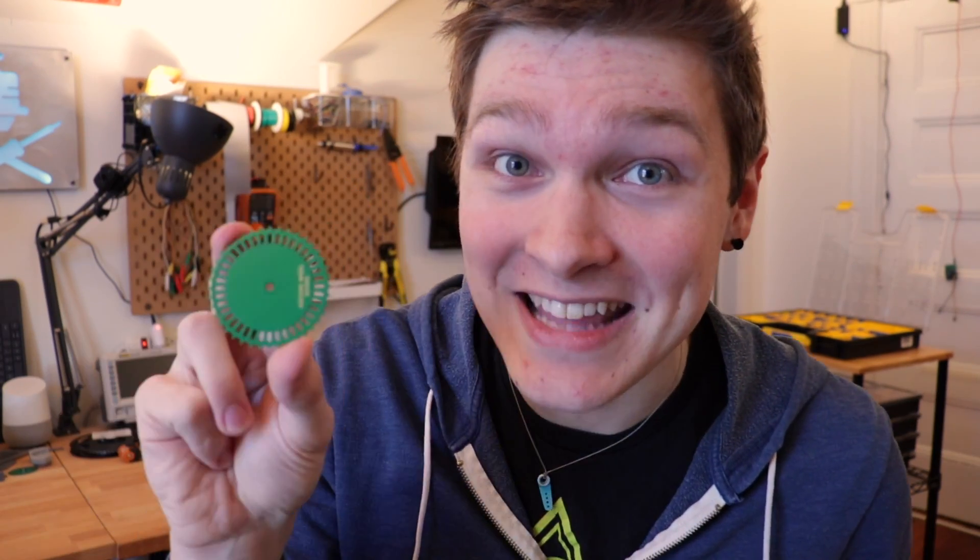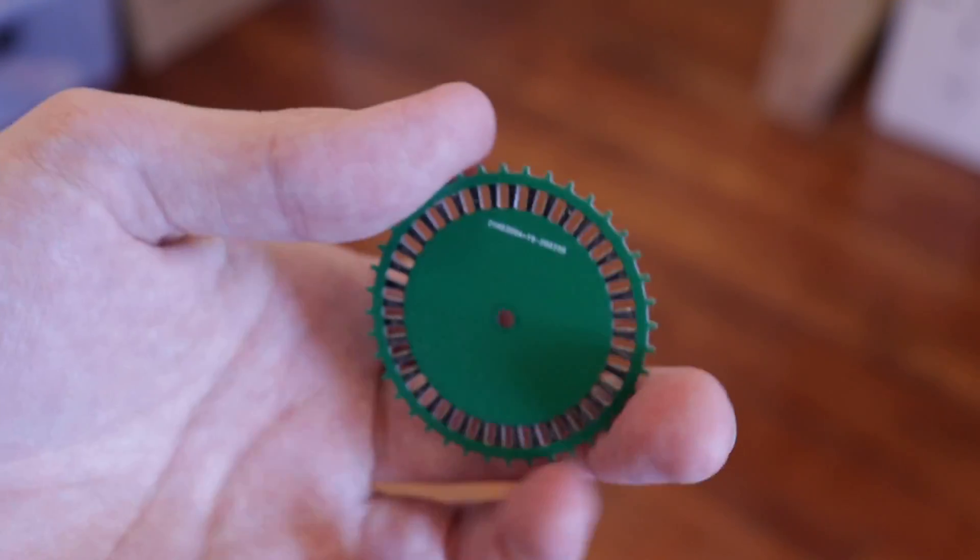Here's the super cool part — I also ordered boards for the indexing wheel. Ordering PCBs is really just a custom way to get a very precisely cut 2D thing of a very specifically known thickness. You can put traces on them, but fundamentally that's what it is. So why not also have them make a mechanical part? Also, because they're a PCB you can plate surfaces. Since it's a reflective sensor, the reflectivity of the thing in front of it matters a lot for getting a clean signal. So I figured why not plate those surfaces in solder — this is such a hack, this is not at all what PCBs are meant to do, but I think it's going to serve its role pretty well.